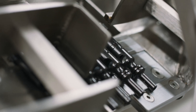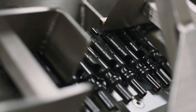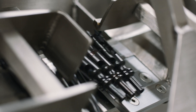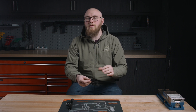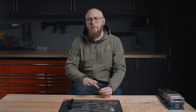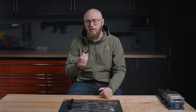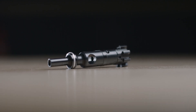The way we ensure the proper heat treat on this is we opted for a flash nitride. That is going to give the bolt the lowest possible temperature during the nitride process to not affect the heat treat. When 9310 is heat treated improperly — whether from the initial making of the material or during the nitride process — it can fail prematurely. It's a very rare occurrence, but it does happen, so we wanted to take steps on this specific bolt to help eliminate that chance and provide a stronger overall part.